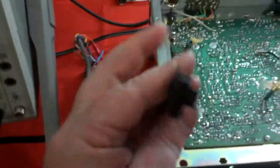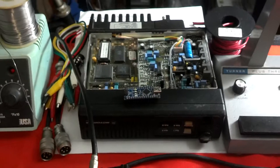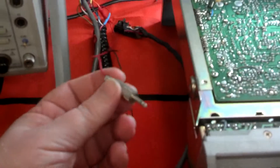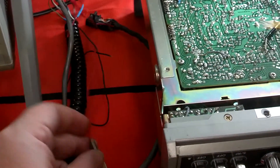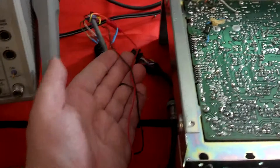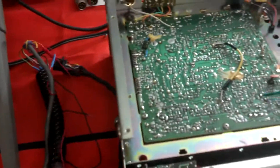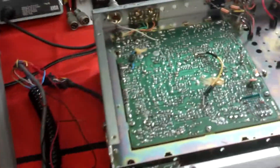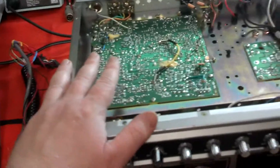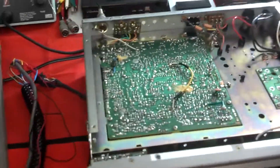These things are bone stock except for this cable they put in there. It has a 16-pin Motorola-style connector — basically the same kind of connector you'd see on one of these MaxTrac mobile radios. This plugged into the speaker of the radio, so it's only one conductor because it's getting its ground through the microphone jack. Then it had an extra red and black wire that would run through the back of the case to power this interface. It basically takes the signal from the CB and puts it over a pair of telephone lines, allowing it to operate through a console on the desk of a dispatcher.